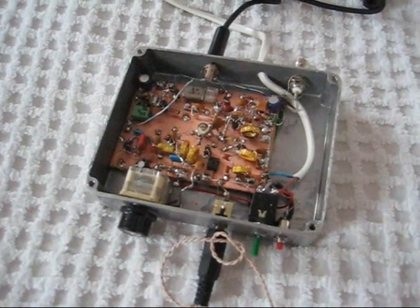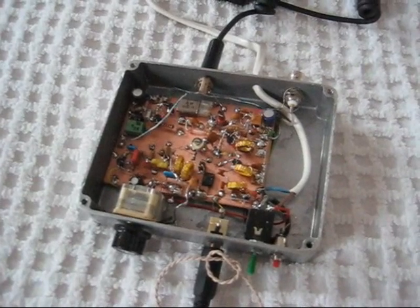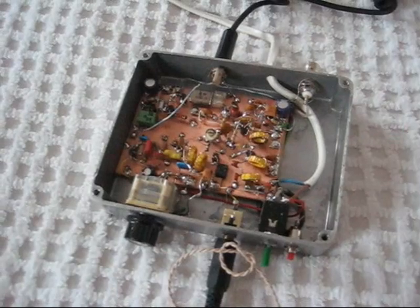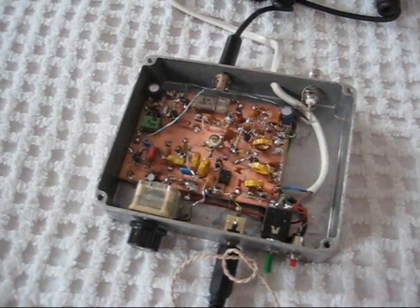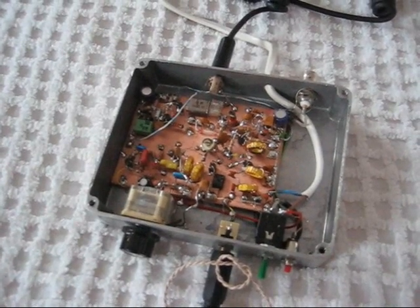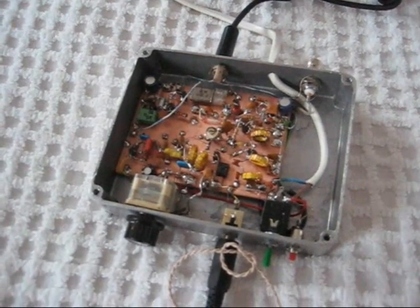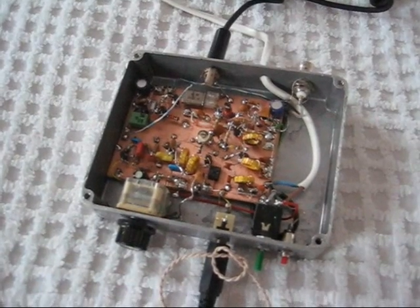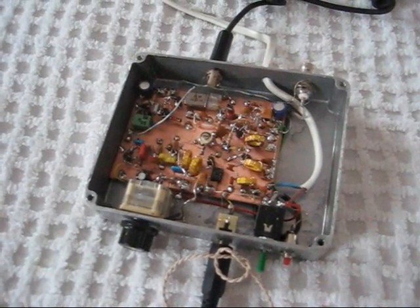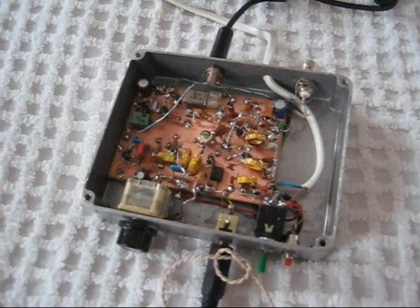Power output is about 40 milliwatts, and the Super-Regen receiver is only really suitable for AM, which it works pretty well. It's fairly broad selectivity but sensitive down to about a microvolt or thereabouts. You can use it as a band monitor receiver, tuning about 49 to 54 MHz. You can soon tell if the band is open and hear sideband stations envelope detected if they're present.